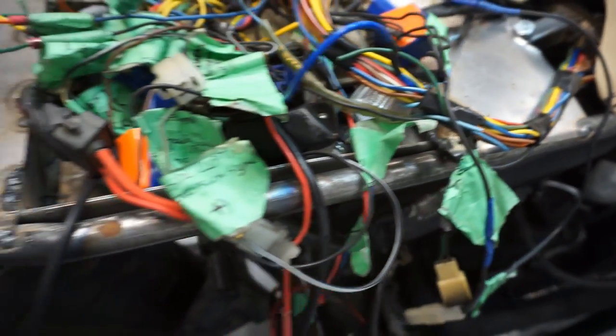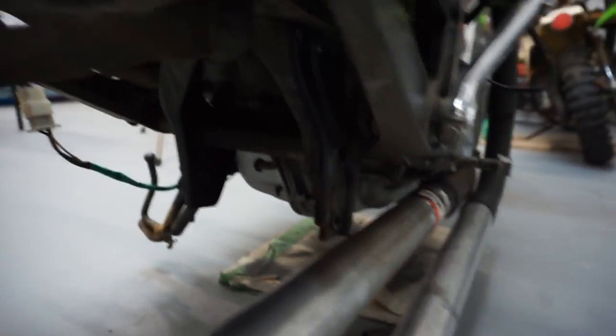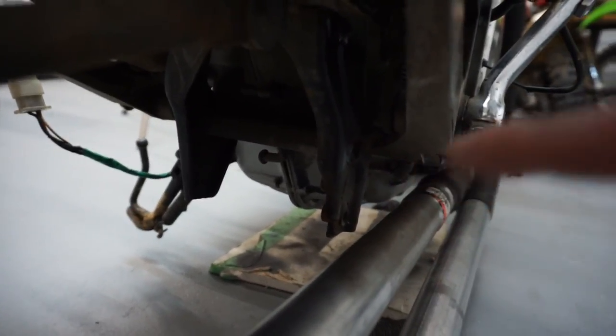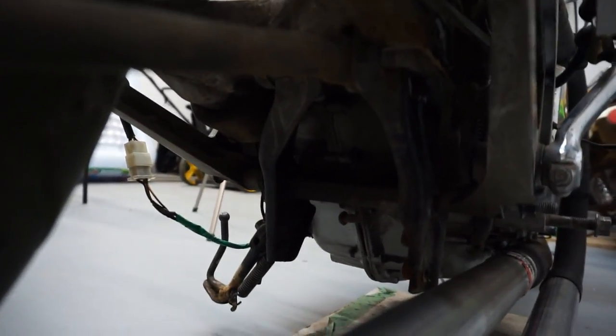Here's the seat pan tray in case you missed it earlier. The reason I did the exhaust like this was to free up all this space right here — that's where the center kickstand used to be, but now I'm going to be able to put the battery there. That's why I wanted the exhaust to come out this way, to free up a lot of space down here. Hope you guys enjoyed that. Don't forget to hit the like button and subscribe, and I'll catch you guys next time. Thanks for watching.